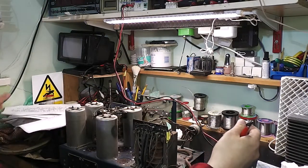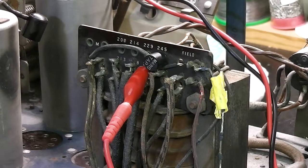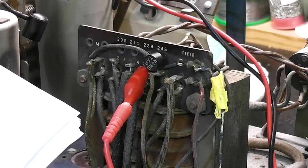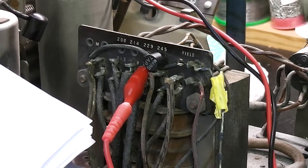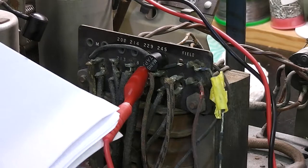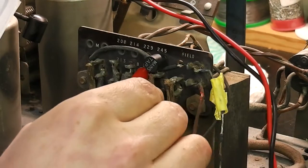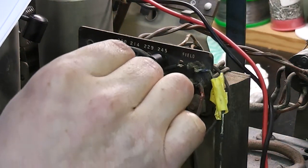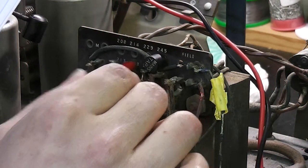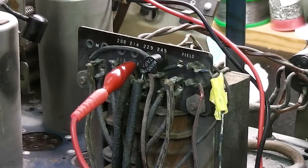The question is just working out the secondary. The obvious thing to do was connect to chassis because that's what one winding is on. Secondary readings: 230 and 210, and I've got 200 and 237 — that's good. So I've got a good secondary there as well. That's looking good.